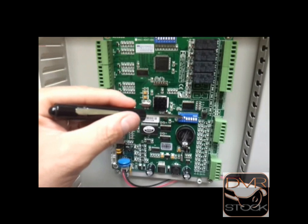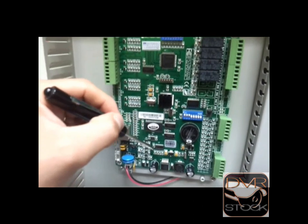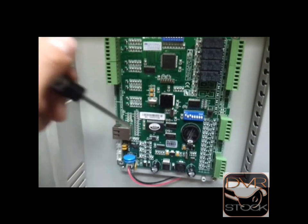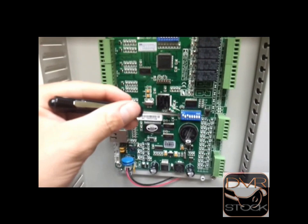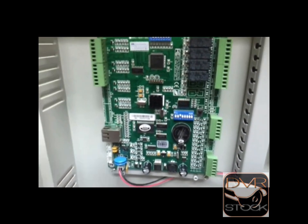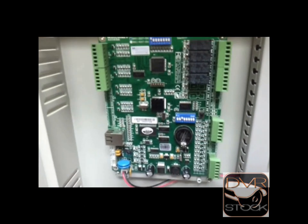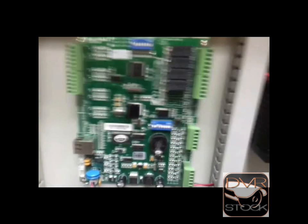Once it's configured, we take out the power, put DIP switch 2 OFF, and leave 1 and 3 up, then plug the power back ON. If we want more security after that, we can take DIP switch number 1 down, then power OFF and ON. That will save the MAC address and the host IP to one specific computer, so no hacker or Wi-Fi laptop can grab that panel and open or close doors. It's dedicated to one computer only.